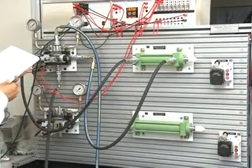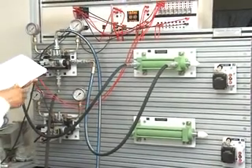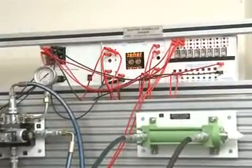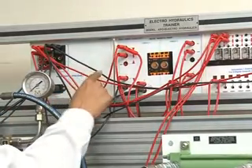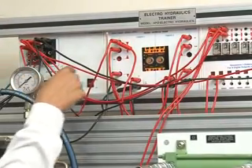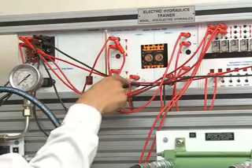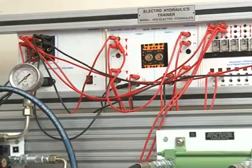For the wiring diagram of the Double Solenoid Valve with Double Acting Cylinder, refer to Figure 5.4. Connect the wires in sequence using patch coding as per page 5.7. Connect the 24 Volt Power Supply to DTP1, the Digital Timer Panel. Connect DTP1 to DTP4, then DTP5 to DTP11, following the patch coding sequence.